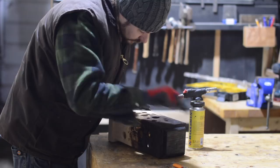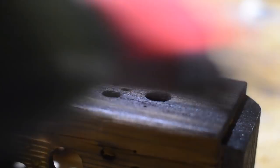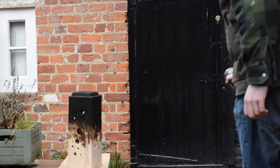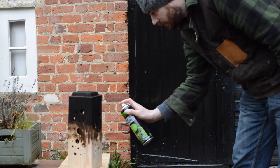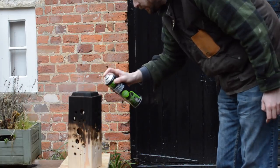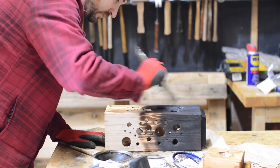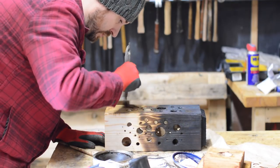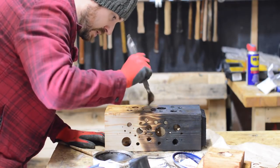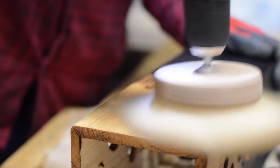When all the fires have eventually gone out, I use a small wire brush to brush along the grain and remove any loose material. I want to apply some finish and I don't want it to fall off, and I don't want the lamp to be dirty to handle. I googled applying finish to charcoal, and surprisingly there were very few results, so I decided just to go for some spray lacquer. I know I said I wanted the burn effect to fade into bare wood, but I didn't like the contrast, so I used some antique pine wax just to soften the transition a little. This could then get buffed off, and I was much more happy with the transition and with the shine it left.